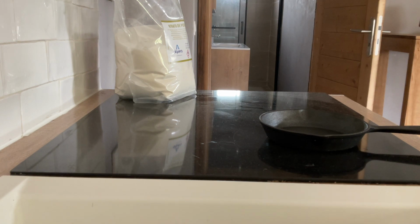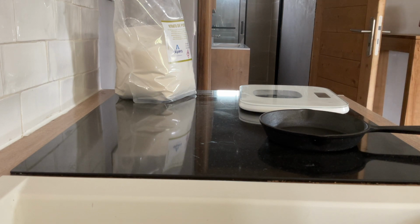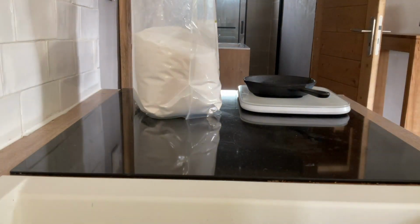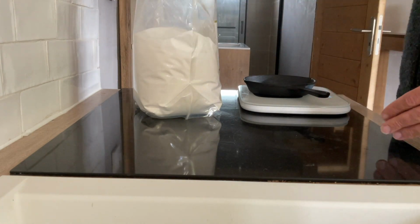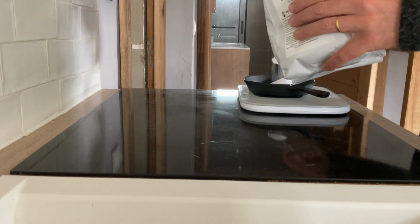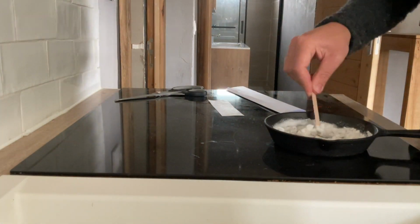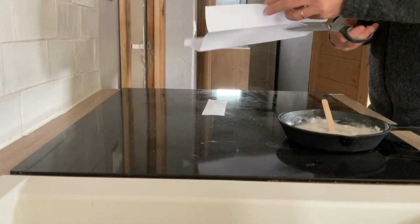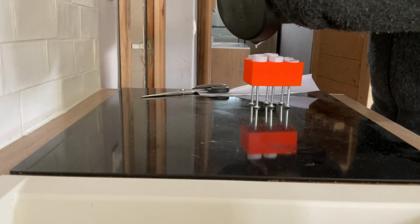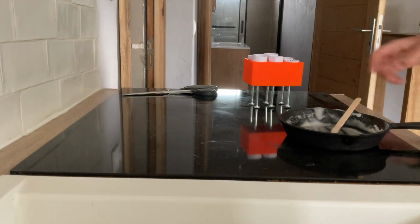So next step is to make rocket fuel for the motors. If you haven't seen this yet, check out my other videos on how to make rocket candy. I mix in potassium nitrate with sorbitol, which melts at low temperature. For this time, I'm experimenting with these 3D printed molds with a screw underneath for the core of the motor.